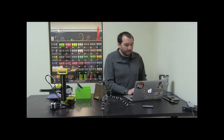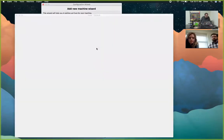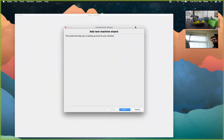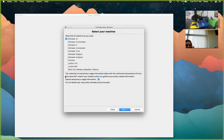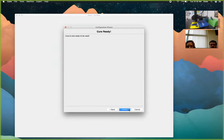I'm going to share my screen so you can see what I see. In the 'Add New Machine Wizard,' we have to set what printer we have and how large the build area is, plus some other profile-specific settings. On 'Select Your Machine,' click 'Other' as the type of printer, hit Next. Then the operating system is 'Mendel' — M-E-N-D-E-L — and then Next.